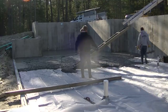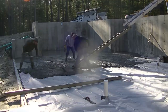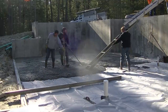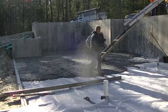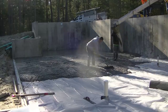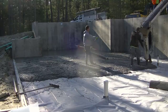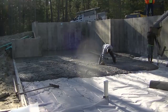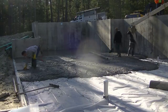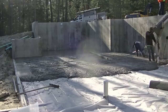We need to set the truck over one more time before we completely empty it — it'll do about half of this basement for us. I like to get the concrete truck dumped out as fast as I can so he can get back on another job. The dispatcher really likes that — he knows I'm going to be fast and he'll get his truck right back, so he can take multiple orders without waiting. You can see how easy that tremie works — hooking on there, keeping splatters down, and controlling where the concrete gets dumped just by holding that boot.